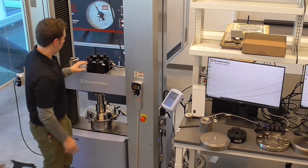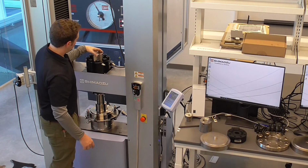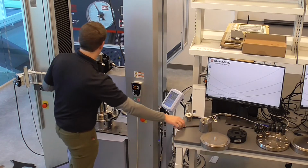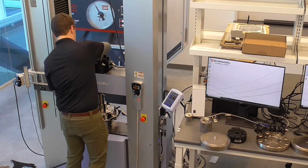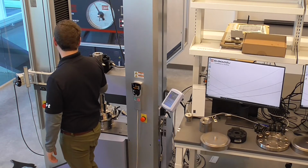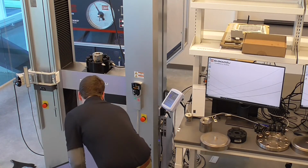And usually at a certain point, when I see some threads sticking out, I'll go to the top load cell bolt, and I'll just tighten from there. And in that way, it'll bring the joint and upper compression plate up. Is the inside diameter of that load cell tapered at all, so there's any forgiveness, or will it hit like a hard stop? There's a slight taper on the joint.